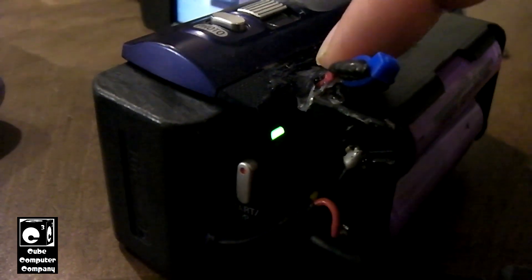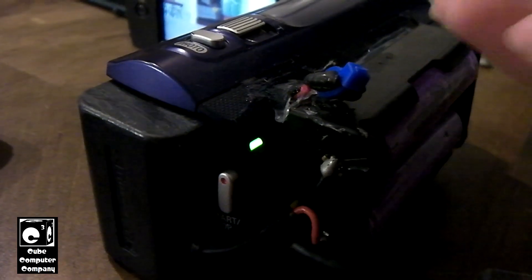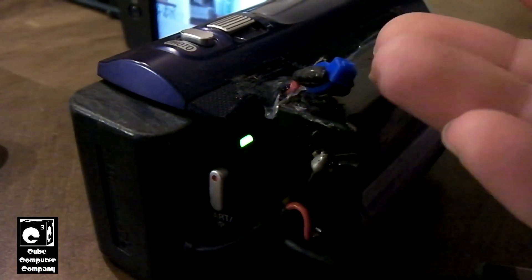What I did is I desoldered the socket from the board and I put in place a couple of wires and I fed them outside the camera — outside the camera where it might be more appropriate to have a socket for a little battery. They could have put it somewhere in the bottom here, like a little compartment. No, no, no — they had to put it deep inside this thing before you had to tear it all apart to get to it. It's just like a slap in the face. Why would they bother putting it on a socket if you had to tear the camera apart just to get to it anyway?